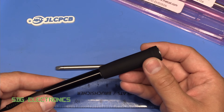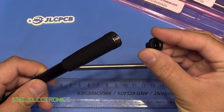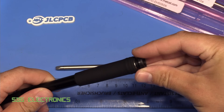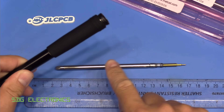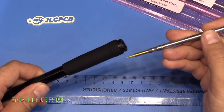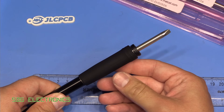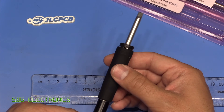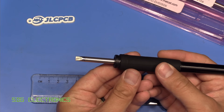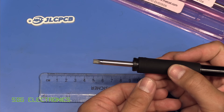When you want to use the handpiece with the integrated cartridge, it comes with an alternative collet that we put in here and screw into the end. This doesn't actually hold anything in when you're using it with the integrated cartridge. So you can just slide this in exactly as you would with the original Metcal station — changing tips without faffing around with the collet. The distance is now much more respectable and probably going to be a lot better to solder with.